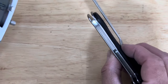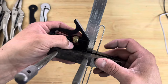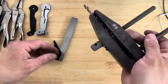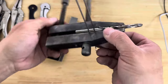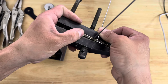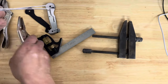I think we're just going to use the same quarter-inch bit we used to begin with. We're trying to make this as square as possible, so I have a parallel clamp — that's looking pretty good. The drill bit is set exactly where I want it to be, and we're just going to start bending it over, making sure we're doing it in the right direction. Now that we have the initial bends, we can finish it off with the needle nose vise grips.